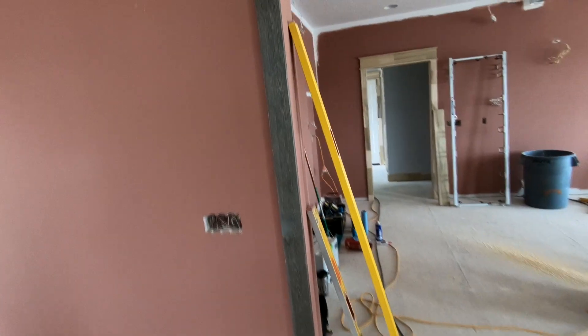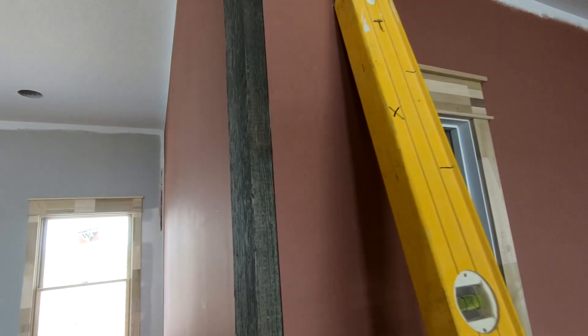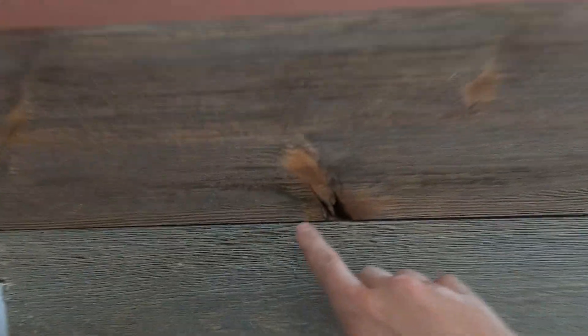Here's what we got for a termination. Keep in mind I've also got a cathedral barn beam running across that end that has to come down into that, so I wanted to keep this transition as flush as possible — barn wood will just butt right into this the whole way. They'll just have to tape and paint it and it'll be fine. Looking at progress: some pieces have a big bow so I'm tight on both ends with a gap in the center, just trying to keep it looking rustic while continuing level as I work up.